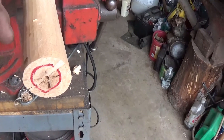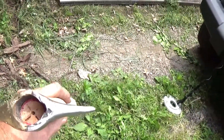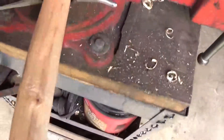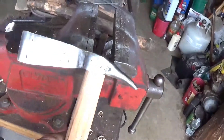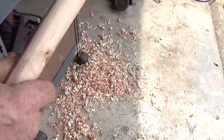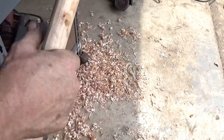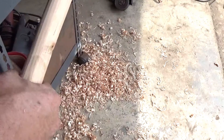Now that I have the handle started, there's a little gap in there - I'll put a quarter-inch piece of wood plug in there. Then I'm going to start drawing back this way with the spoke shave, curving it in. You know you have a good fit when you have all those wood shavings. This is about a 20-inch handle - the grip is just way too big, so I'm going to start thinning this section out, almost like you see on a hammer, and then down here I want a nice solid grip.